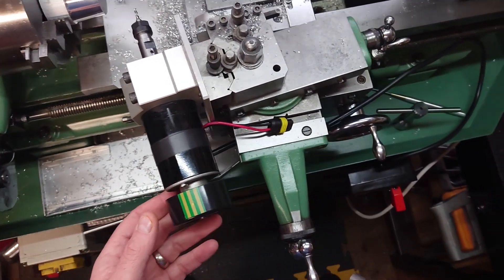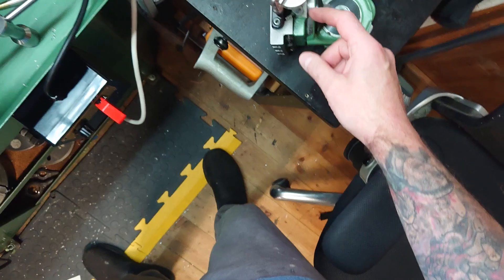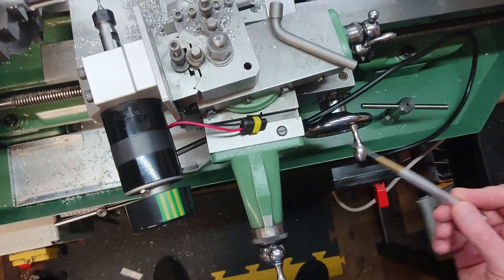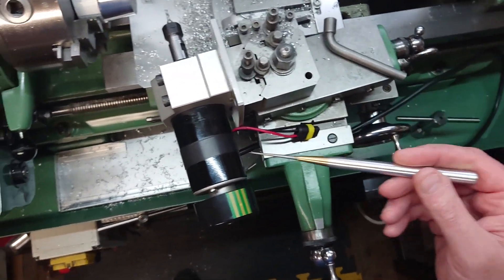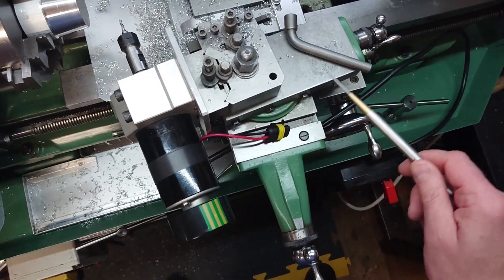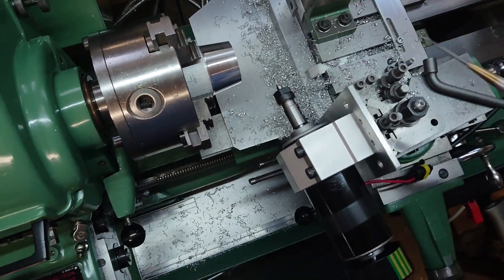You might remember in a previous YouTube clip I had this mounted on the Myford milling attachment. Now that fits on the cross slide here, but the problem with that is I've only got that movement and that movement — I haven't got any angular movement. So what I wanted to do is mount that on the compound slide so I could machine a slot at whatever angle into what I've got on the lathe spindle here.